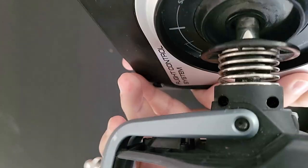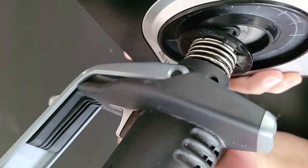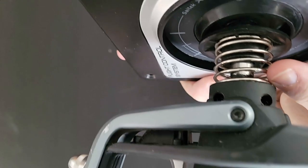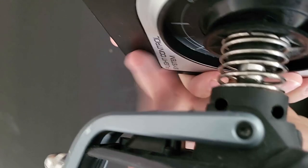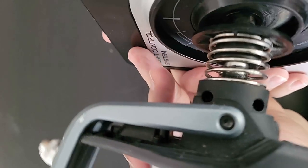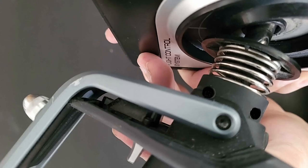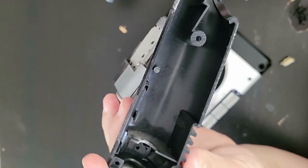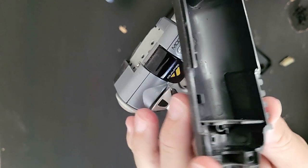The top part of this gimbal operates using a spring, an angled plate and a cup. The plate pushes up against the cup as your axis moves, and it compresses the spring. This area between the plate and the cup is a natural wear location. I've used some lubrication, but it still wears down rather badly. The stick shell is hard plastic, covered by rubber, which we discussed before. The molding seems pretty average.